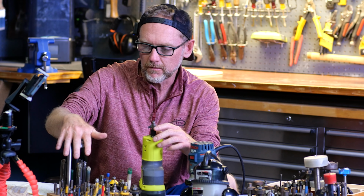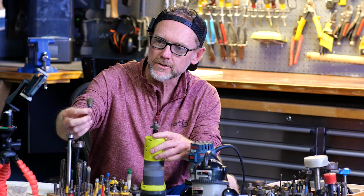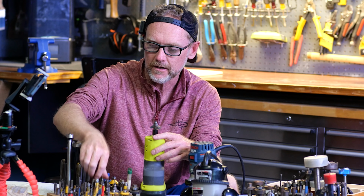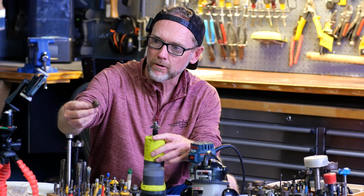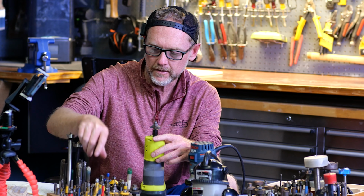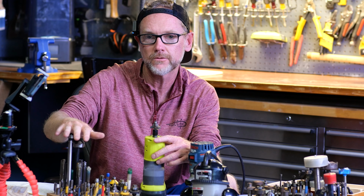Store them in a clean, dry place. Because oftentimes you'll notice that the manufacturers will provide these bits to you coated in a rubber or a wax. And that's just an indication that they do eventually wear or rust away, especially after heavy use on certain woods. So clean them before you store them. It'll keep them sharper longer. It'll prevent some little bits of corrosion that are microscopic, but they actually may show through eventually on some of your fine woodworking projects.